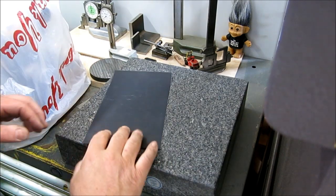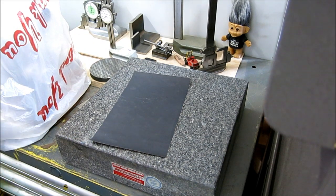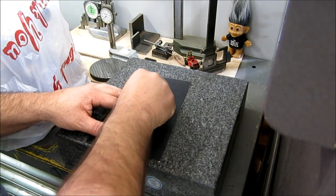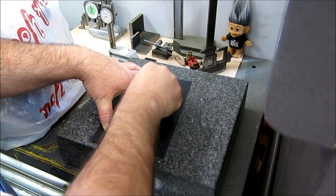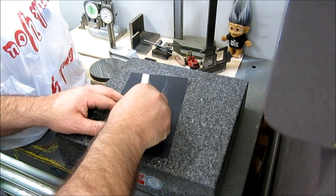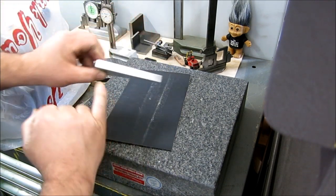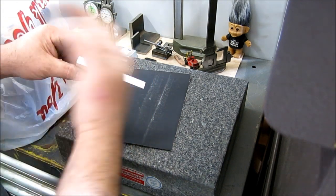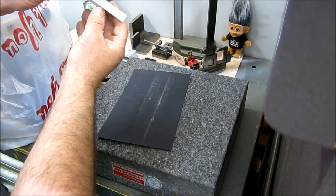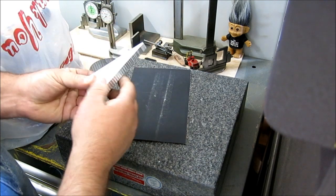So we're over here on our little small surface plate, and this is just 600 grit wet-dry paper. What we're going to do here is that edge that we just milled — we're just going to gently lap that a few strokes until the tool marks are gone. I deburred it so I don't have to file it after I lapped it. So now this is our reference edge. I'm liking the look of that.